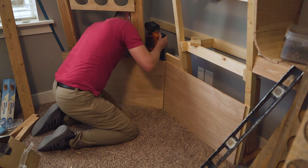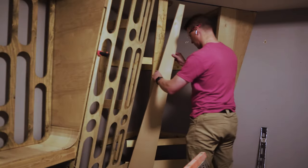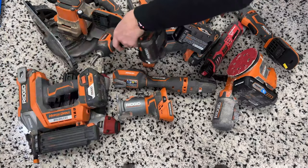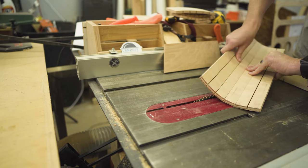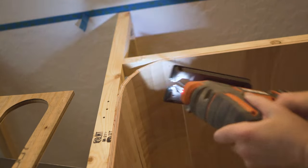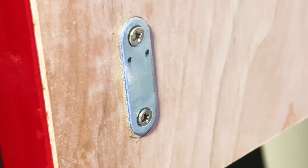With my light panels cut out, I just had to figure out how to cut the rest of the panels for the walls and the small table in front. This was largely trial and error — a lot of measuring and several wasted pieces of half-inch plywood. This project required pretty much every power tool I own, and I love using my power tools. Another tricky part was creating rounded corners for the center recess. I decided to use a technique called kerf bending, which involves making a bunch of cuts most of the way through a piece of wood so you're only bending the very thinnest outside portion. I later filled that in with wood putty and I think it came out pretty great. I then framed in all the shelving supports and attached all the doors using surface-mount cabinetry hinges, with magnetic catches to keep all the doors closed.